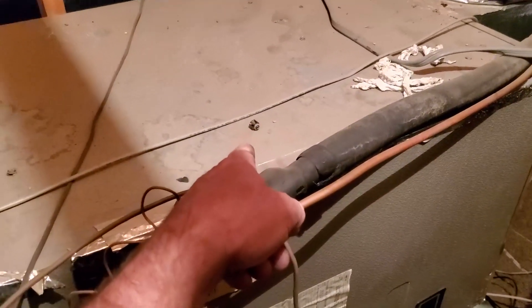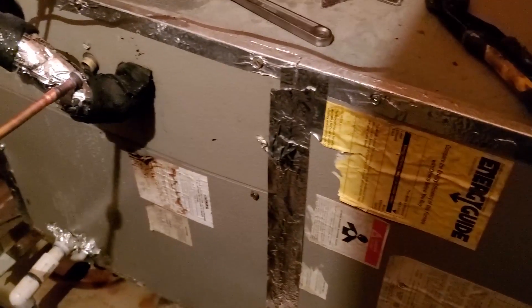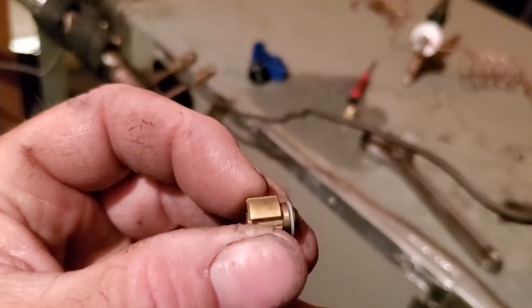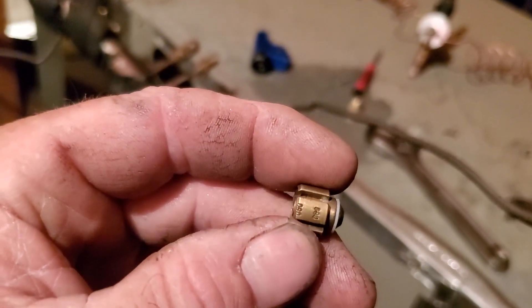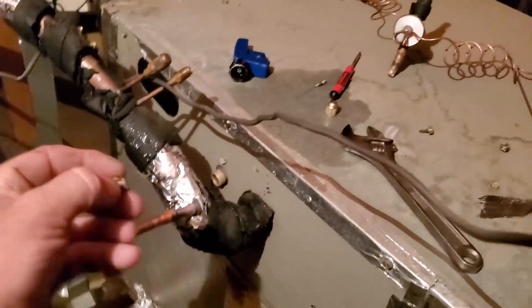That piston over there was laying there, but it was a little small. I looked it up and it said 80 to 82 or 80 to 83 for a four-ton condenser with a four-ton air handler — Goodman. So that's what I got. I got an 80 that happened to be in my old stash. Pretty good size opening. Going to put that in right here.